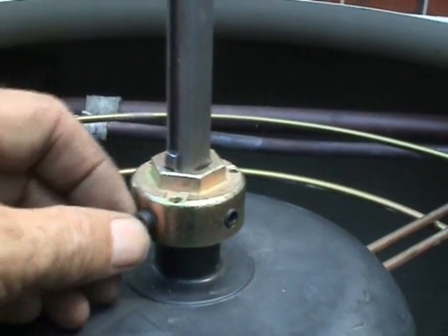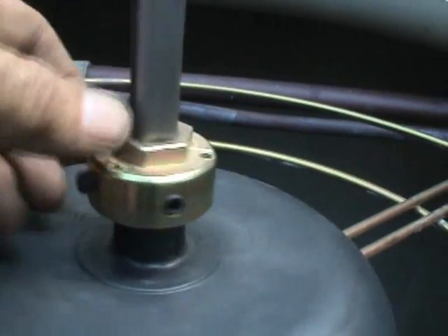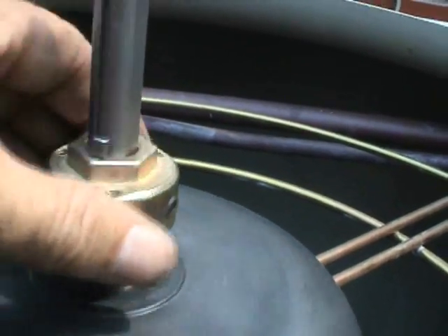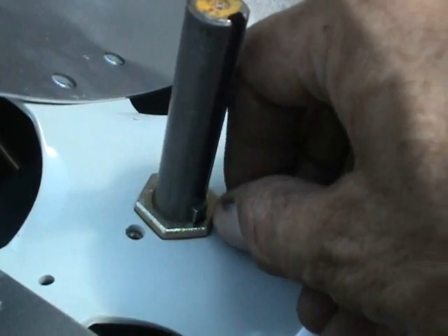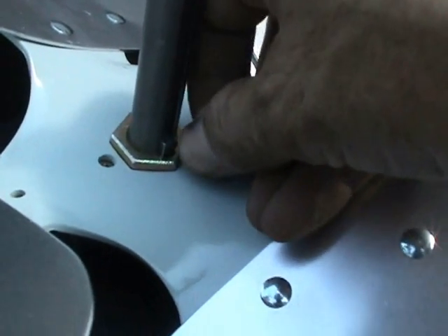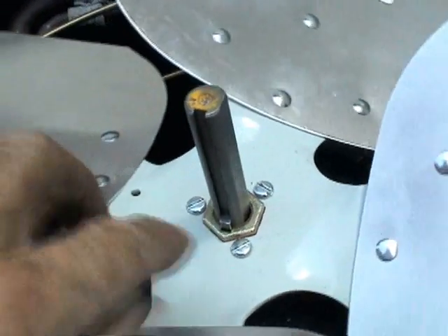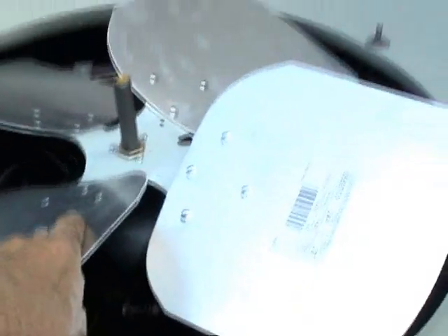You have to make sure that when you put in the set screw it catches the key on the inside, which will press it against the shaft. We've got the set screw in there, holding the keyway into the shaft. Then on the other side, I put another set screw to hold the flat side of the shaft — nice and snug. Now I can set the blade into position and put the screws through the blade and into the hub — that's how it's held down. Sometimes these screws can be a tussle. All the screws are in place holding down the blade on the shaft.